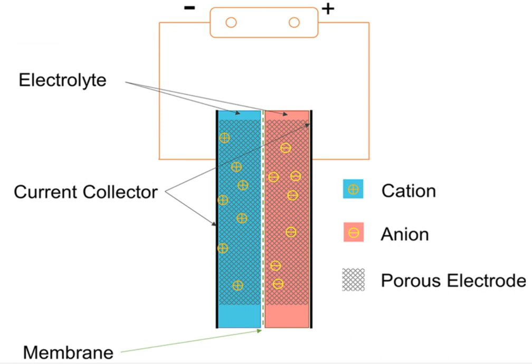In 2012, tram operator Geneva Public Transport began tests of an LRV equipped with a prototype roof-mounted supercapacitor unit to recover braking energy. Siemens is delivering supercapacitor-enhanced light rail transport systems that include mobile storage. Hong Kong South Island Metro line is to be equipped with two 2 MW energy storage units that are expected to reduce energy consumption by 10%.